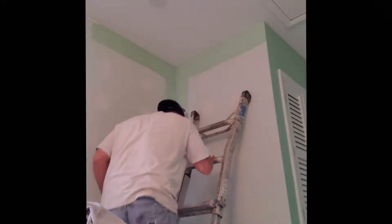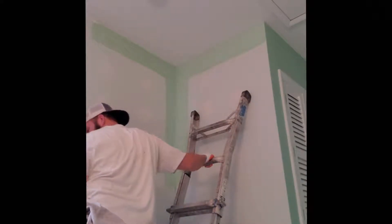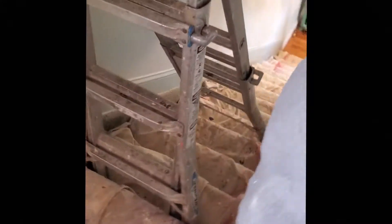I'm just taking my time with the roller now. I like the roller — it gives that stipple effect and you get less brush strokes. It really helps to make your paint job look professional.